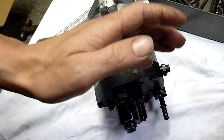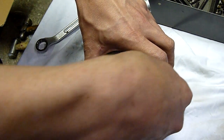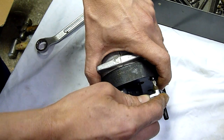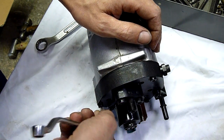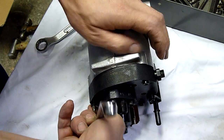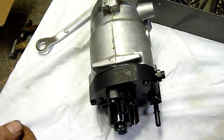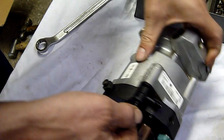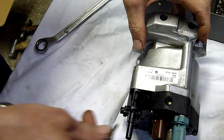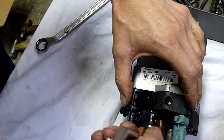and having metallic debris go through those spill valves at 33,000 psi down to probably 100 psi or something line pressure at the most, maybe even lower, because this fitting's all plastic, so it wouldn't be very high pressure. That would have an incredible abrasive effect on the internals of the system. And obviously it destroyed the injectors.